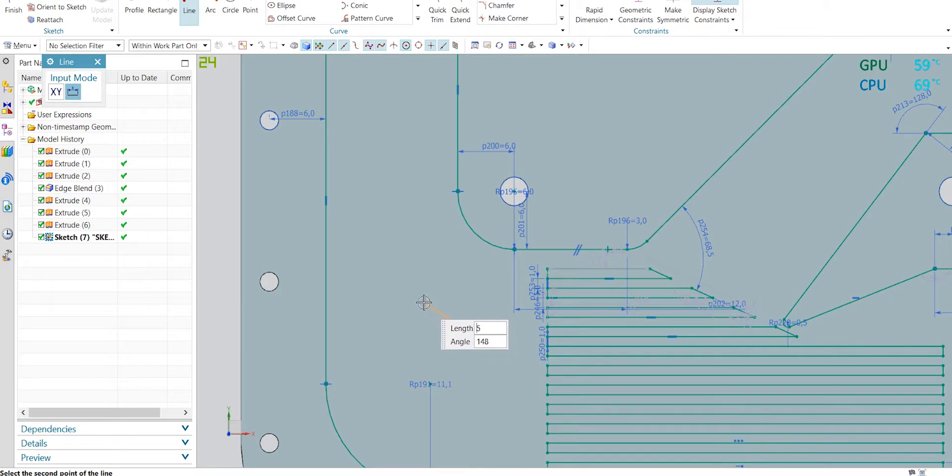This small taper is just so that the water flow is a little bit more pronounced and obvious, reducing turbulence. Since the weak points of the water block will be the inlet and outlet channels, I want to minimize turbulence there as much as I can.